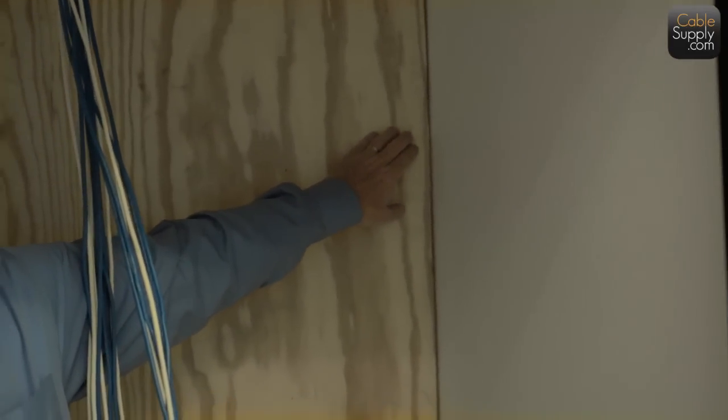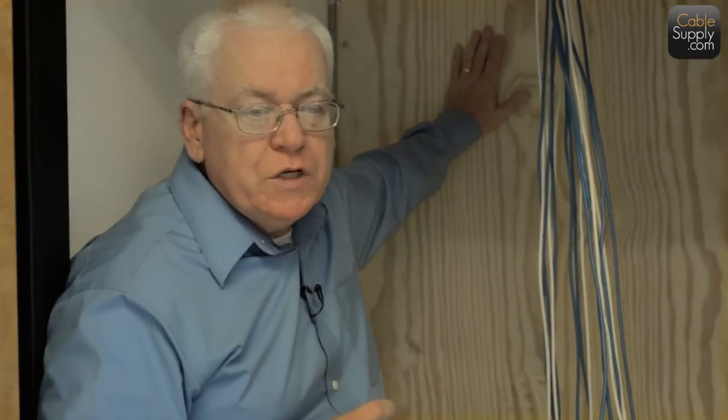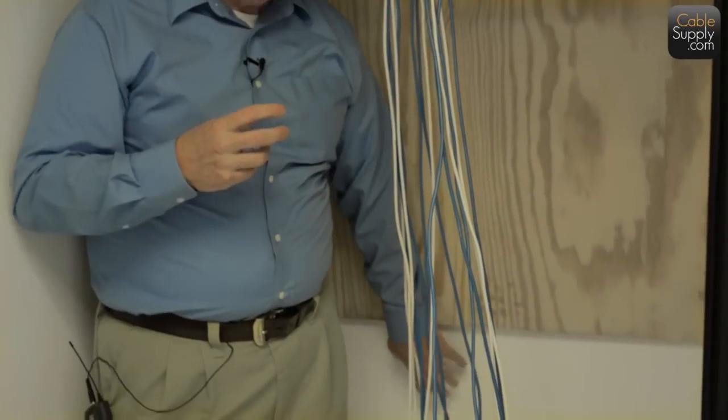It's going to take them right out of the cement. So you want to use short screws, thick backboard, when you're going up against a cement backing in the back of the backboard. But this backboard gives us something that we can mount equipment to. It's really hard to mount all the equipment and all the screws you got to put in these things just to cement or even to drywall.